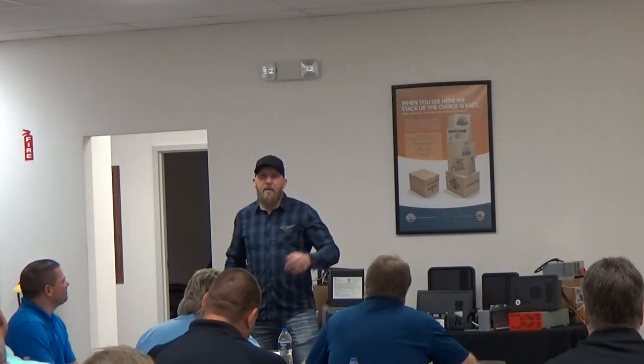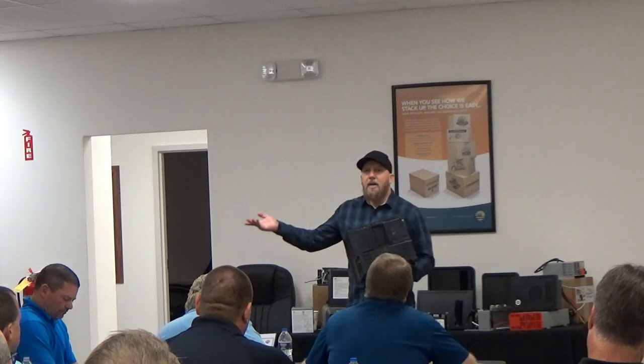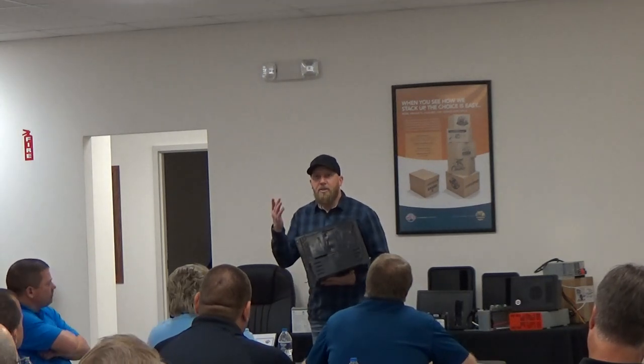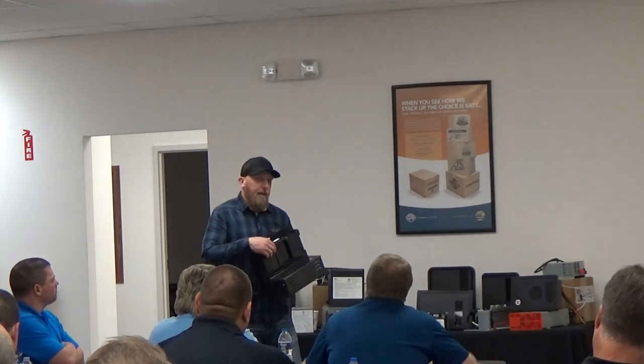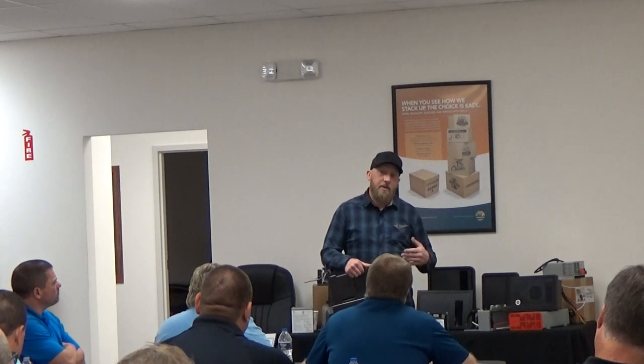In an RV, because they do not design an RV around this. They put this wherever it fits. So they don't design in their plans, oh, we're going to put converters here. Now they put the RV together, and then they're like, well, this wall has a little bit of space behind it, so we'll pop it there. So they just put this where it fits. So sometimes they just don't have enough space, and that's why our guys are out there every day, and they actually measure, they go through and say, you need to cut a vent hole or something. So if there's not enough space, they'll have them pop a vent hole in, so it does get cold air in there.